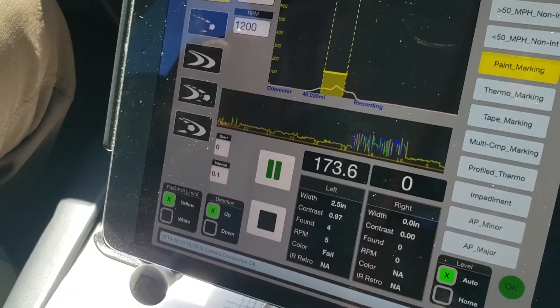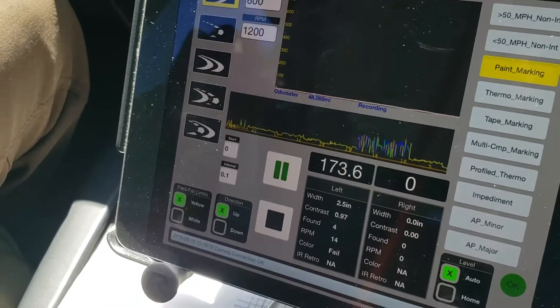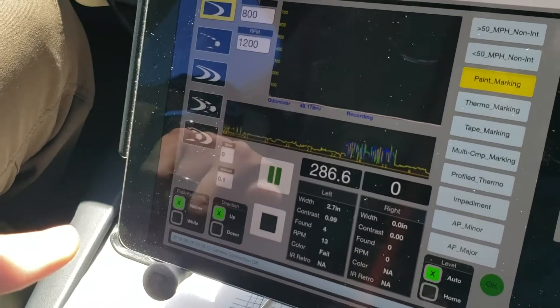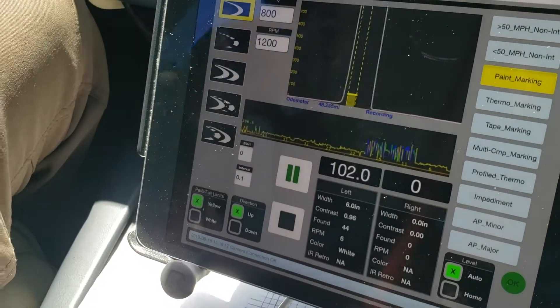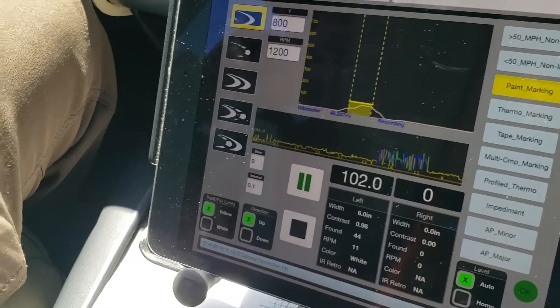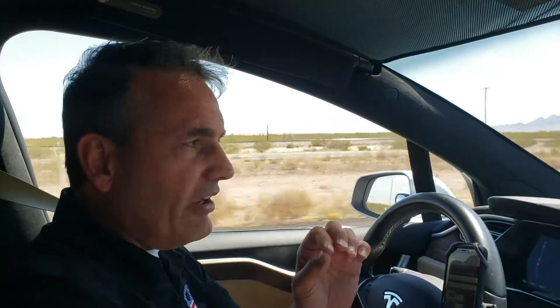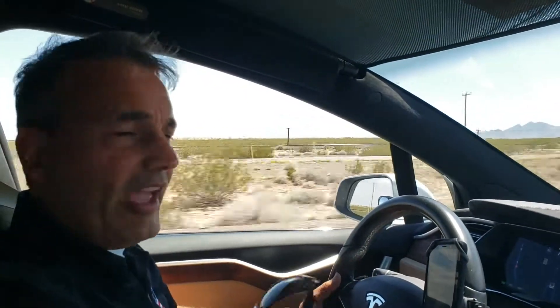When we take a closer look, this is paint, and what it appears to be is that the millage on the paint is not thick enough to properly retain those beads. So especially in certain areas, those beads are just going to pop out and reduce that retro-reflectivity. You have to remember that if you're applying paint, you have to have your mil thickness sufficient so that the beads can be retained and get the embedment that they need.